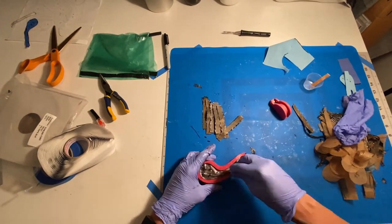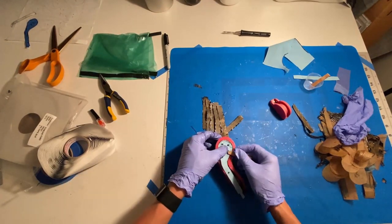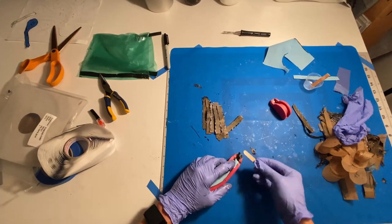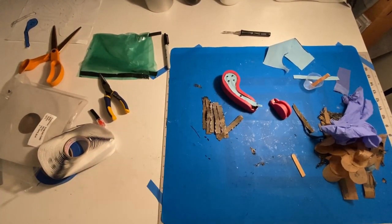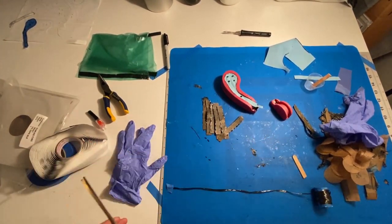Another thing I learned here is to cut the release film and breather larger than the size of the part. During the vacuum process, things shift around, and in this case, some of the breather made direct contact with the part, and now I have some paper towel permanently stuck to the part, so I'm definitely making the release film larger than the part next time.